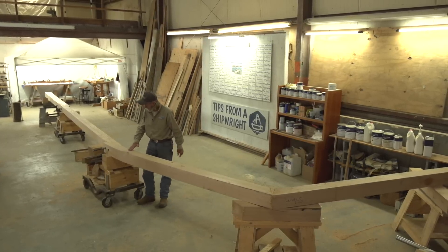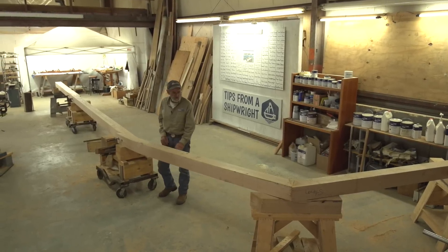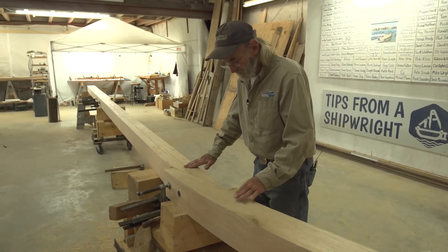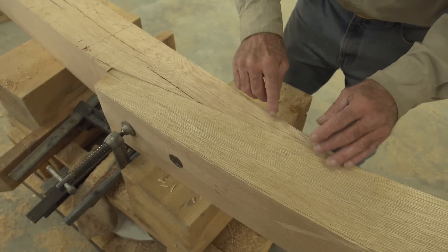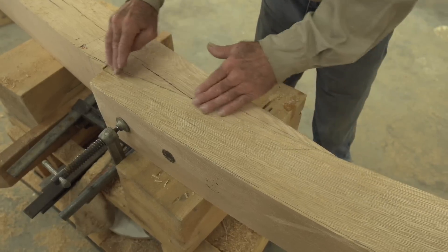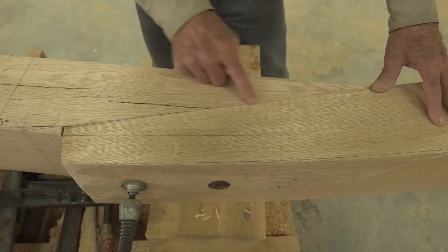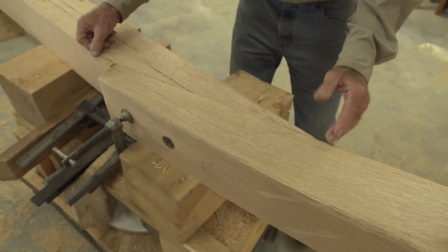Well, now we're getting somewhere. We've got the two sections of the keel right here and the forefoot right here joined together. We're just about ready to make the joint between the stem and the forefoot with the gripe in between. These are the two pieces we connected — this is the forward end of the keel and this is the after end of the forefoot. I only really cut this piece right here to bump into that piece. The back of this is just a nice straight cut off of my planer. It's going to have one stopwater where the joint crosses the rabbet line, right down along in here where you see the edge of the planking.